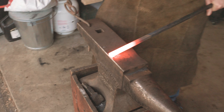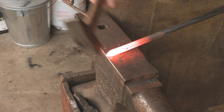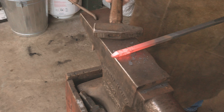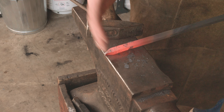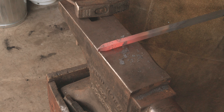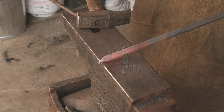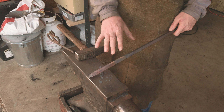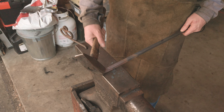We've got our steel. Let's talk about one problem that we may run into. You can see I've got a bit of a hangover there — where it's not coming to a point, it's leaning over. The reason for that is I'm not holding it at the edge of the anvil. If you're hanging the steel over the edge, you're going to get that kind of hangover where you're forging the steel down around the corner of the anvil. The real key to fixing this is making sure that your steel is right there at the edge of the anvil. You can take the steel and steady it against your hip in order to keep it nice and steady. The closer to it that you can hold it, the more control you're going to have, the easier it'll be to hold it there on the edge.